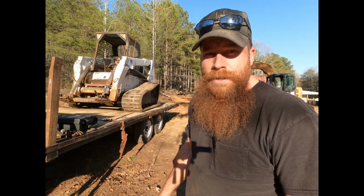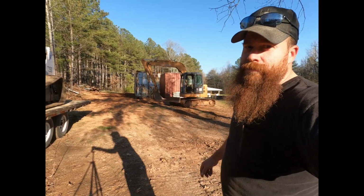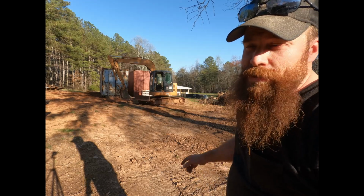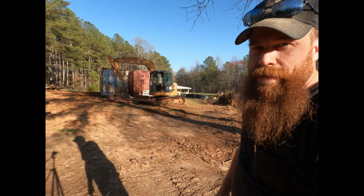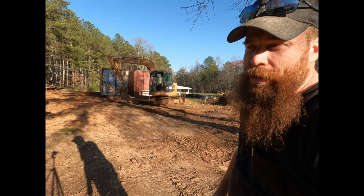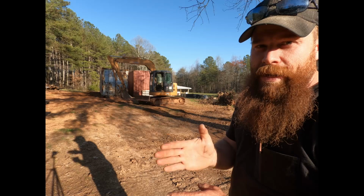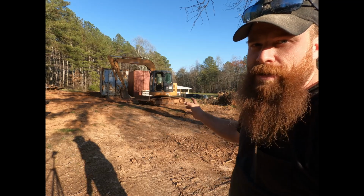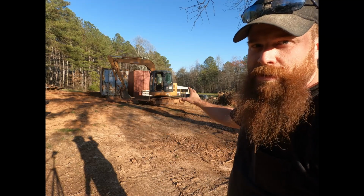I guess right now is a pretty good time to introduce you to Casey. Casey is my other acquisition. At least Casey's what my kids call it anyways. This is about a 2003 model Case CX-75. The CX-75 and the CX-80 were about the same model, except the 75 went straight up and down with the boom and the 80 had the pivot on the boom. This one, like you see, has got steel tracks. This is a 16,000 pound machine. Phil over here weighs about 9,000. This is called a midi.